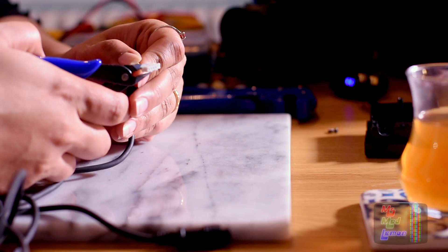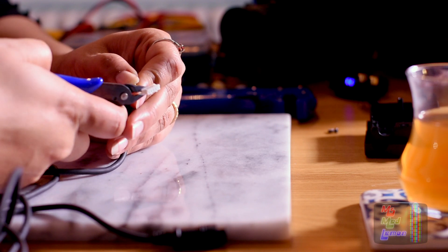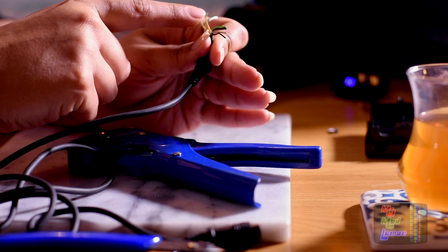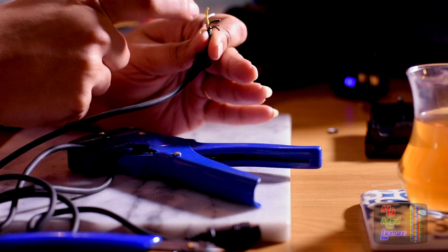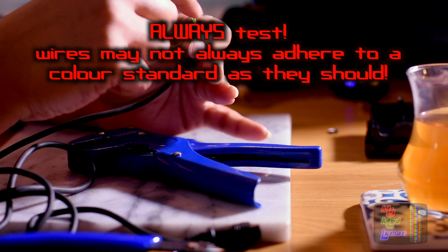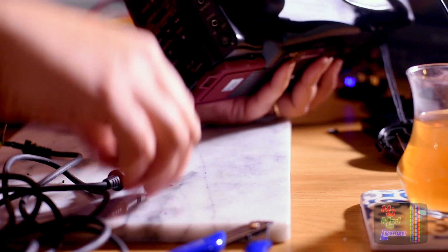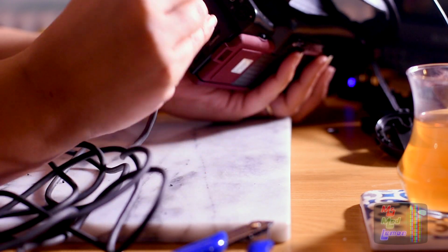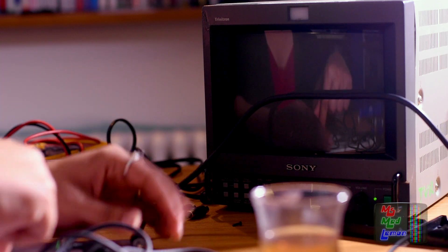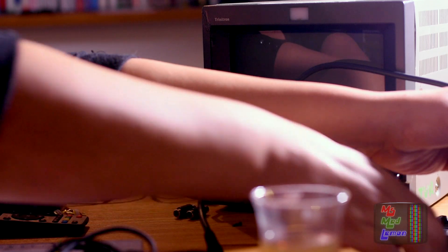Okay, let's just snip this thing off. My guess is that the two thicker wires are going to be the video ones — I'm just figuring it out. I'm going to strip both the grounds. Let's set the camera up and connect this. Just to see if the PVM settings are fine, I'm going to connect this to something else's composite output.